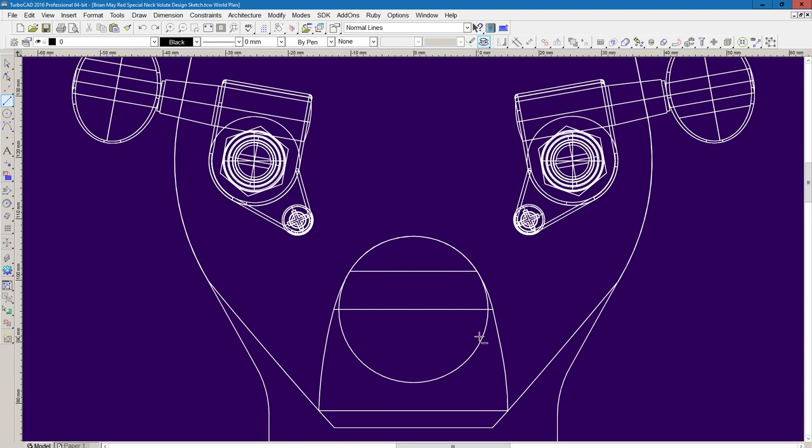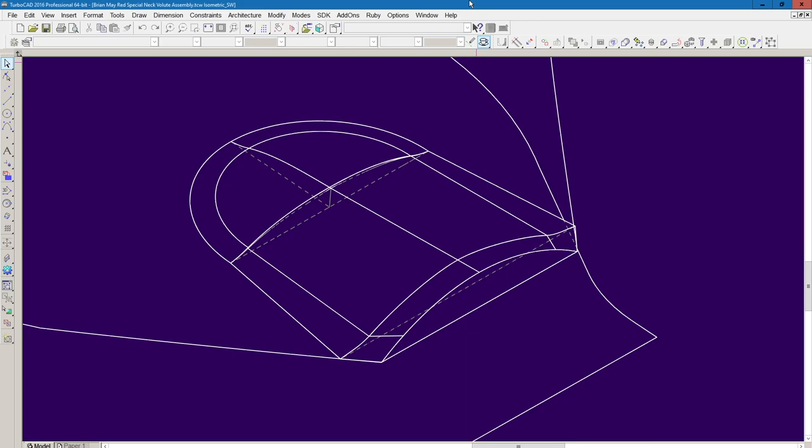Turning to the enigmatic volute or bump, which blends the main section into the headstock and adds extra depth under the truss rod adjuster bolt rebate, I first sketched the outline and plan to set the overall size and form. I based it on a circle which could be 1 inch in diameter, but I've made it slightly smaller to form a widened parabola. The volute appears to extend about 1 1/8 inch forward of the return curve.